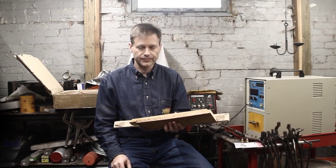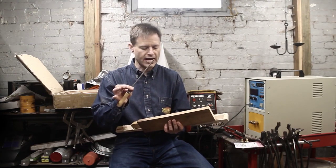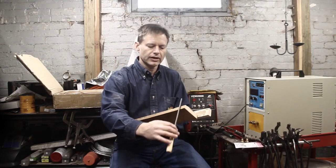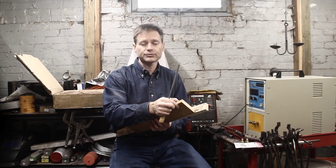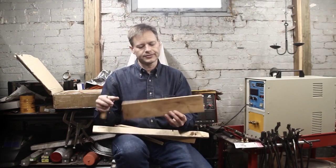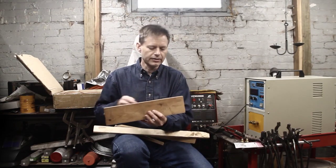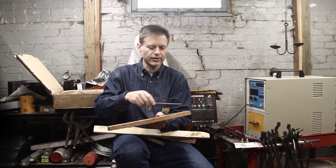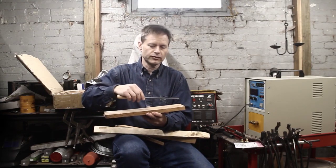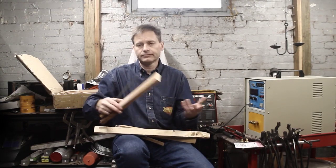When I make the square cross-section coils, I use wood to make the mandrel. What I tend to do is use this rasp, which makes a notch that fits quarter inch or six millimeter quite nicely, to actually make the form with corner support — that allows me to do a fairly tight corner and not collapse the tubing. I'll cut it to the sizes I need with my band saw, put in all the grooves including a little mark on the front. On the faces I do the wrapping with the advance I want, and I do the advance generally on the face, straight across on the sides, then burn it out.